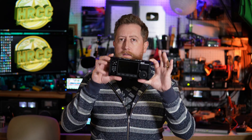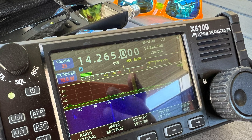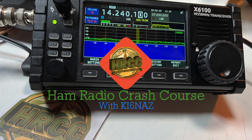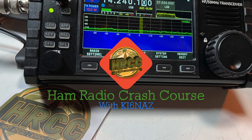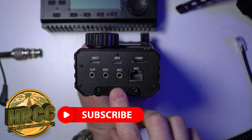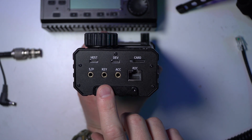How's it going everybody? Do you have one of these X6100s and have dreams of getting on the radio with digital modes? I'm going to show you how to set it up. It's actually pretty straightforward, but there are a couple little tips and tricks that I learned setting this up for the first time. Grab your laptop or computer, just plug the radio in. You're going to be using the DEV port — that's right, don't use the HOST port, that's for upgrading the firmware. Use the DEV port, that USB-C port.